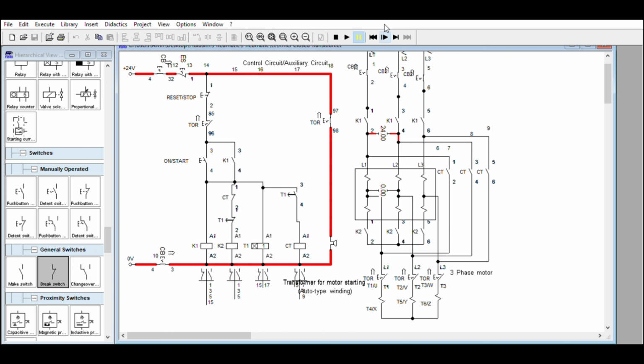Okay, alarm. Do not reset the overload relay in reality. Find the mechanical trouble or electrical trouble of the motor why the overload relay is tripping off. Assess the trouble. What should be done? Is this the right size according to the motor specification? Refer to your electrical code, IEC or IEEE or any good source of electrical engineering. And this is it about auto transformer starting.